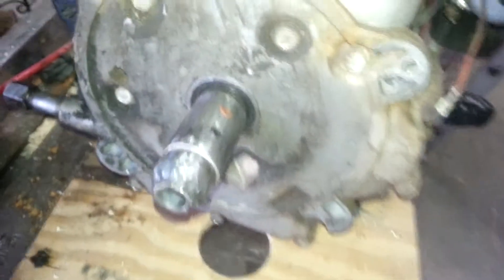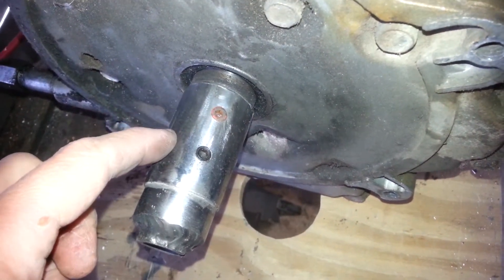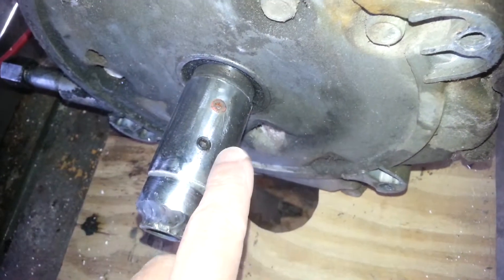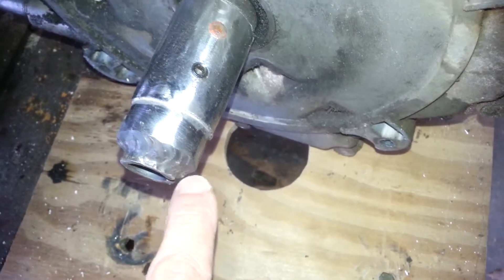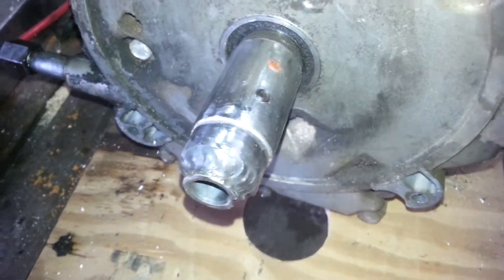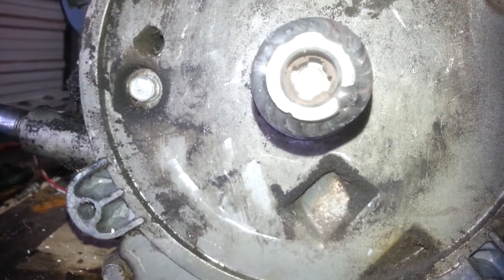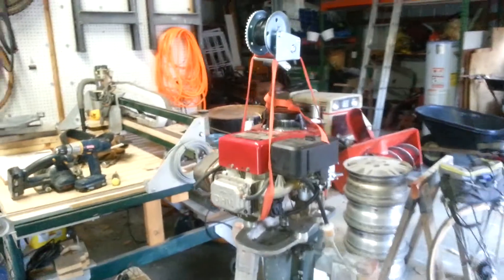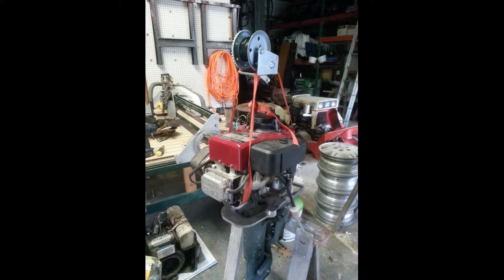Here's a little detail of the shaft coupling. This here is what's left of the pulley shaft — pulley sleeve, I guess you'd call it. I cut the pulleys off, put the set screws in, and it still has its original key. I TIG welded the end of the crankshaft, which fit exactly into there. And there's the original 42-spline. I'm very carefully lowering the motor down onto the adapter plate, engaging the coupling, taking care not to push the drive shaft to one side or the other so that it's perfectly aligned.